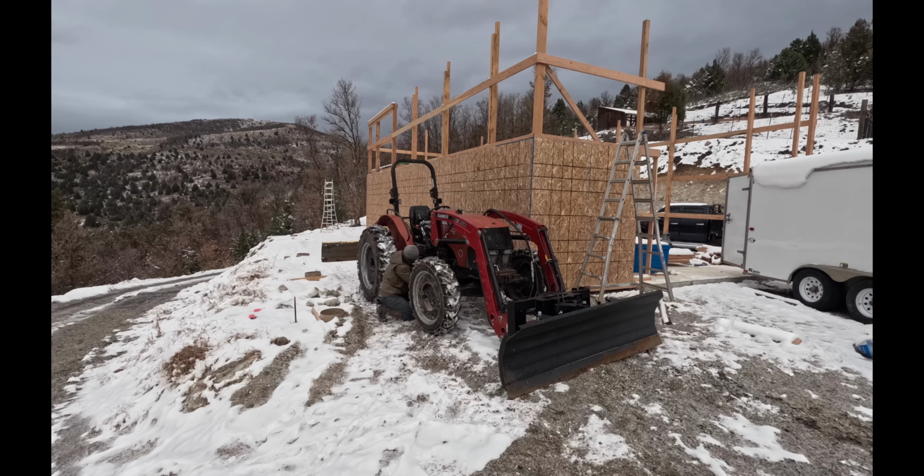I also had to go in and pick up my hydraulic filter. As it's coming late into this fall, I noticed that my hydraulics are getting slow and they're chirping a little bit and having a hard time, and I think my filter's finally getting plugged up enough that it's starting to cause cavitation. I've gotten several of these different hydraulic attachments for this machine in the last year or two, and so there's been a lot of cross connections, and every time you do that there's always a potential for some cross contamination of the fluid, at least initially. So I'm sure it's probably that. There may have been a little bit of moisture that's gotten into the filter too, so I'm gonna change the filter, put that tire chain on, and then we should be good to go for this storm.